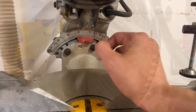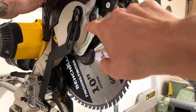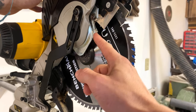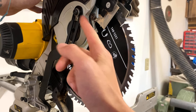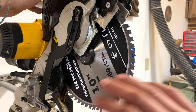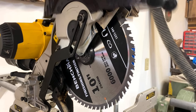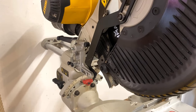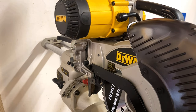When you want to change out your blade, you lift this up, loosen this little bolt right here — it doesn't have to come all the way out — and once that's loose, this piece pops up and gives you access to your bolts for changing your blade. Super simple, takes me about five minutes, maybe not even that. When you need to lock it down for transportation, you just push this down, push that little button in, and it's locked — super easy, and it never goes in when you don't want it to.